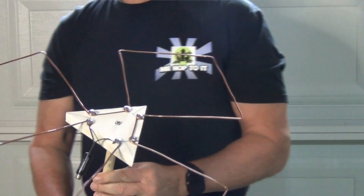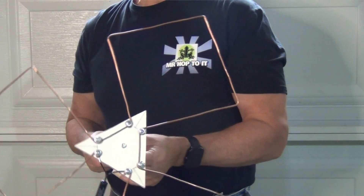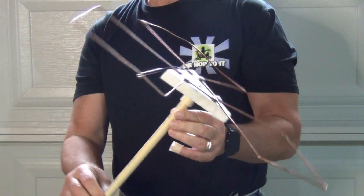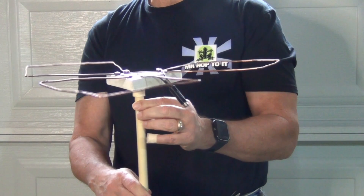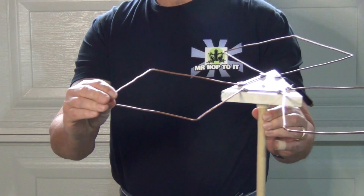Next is the smallest antenna in this test, the three-diamond antenna. This was designed for a friend that wanted an inconspicuous antenna that could be mounted outside. Still multi-directional and made on a horizontal plane, each diamond is constructed from solid 10-gauge wire. Although simple to make, it does take some basic woodworking skills to complete.